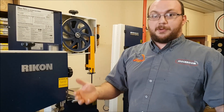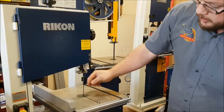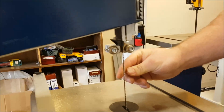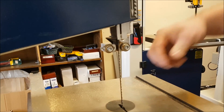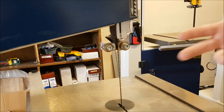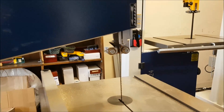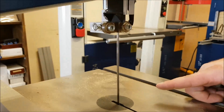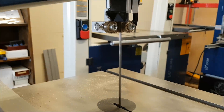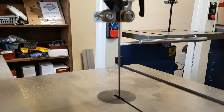The way I tension the blade, if I'm trying to do it properly, is like this. First thing I do, I take the guides away from the blade and have it just loose. So that's a 3/16ths — this is the same blade that Linwood's using. I just tension it so I know that blade is not going to fall off my bandsaw. Once we have it there, with bottom and top guides off, you turn it on and watch the blade. You can see it vibrating. What I'm going to do is tighten it up until I can see that blade straightened right out.